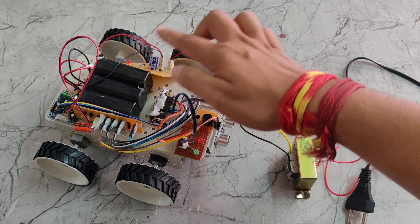For the power supply, we give 12 volts to the L293D motor driver. From the L293D we take a 5-volt supply using a voltage regulator called 7805, which steps down 12 volts to 5 volts. That 5 volts is given to the track PCB, whose main purpose is to equally distribute the 5-volt supply to all the components, since they all operate on 5 volts DC.